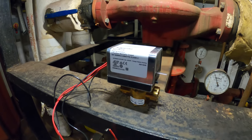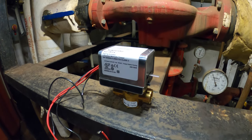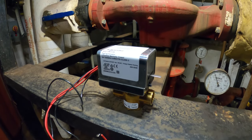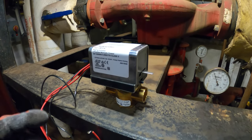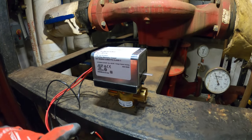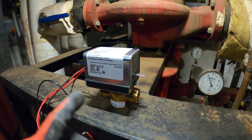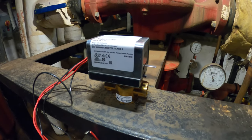Right now it's actually a tricky season where the water is chilled and cold. So if you ask for cooling it's going to open the valve, but if you ask for heating, the auto changeover switch or the pipe sensor is going to sense that the water is cold. Instead of opening this actuator and cooling the room — because with a two-pipe system it's either heating or cooling — it's going to send power to an electrical heater that's in the system.